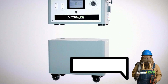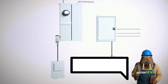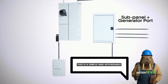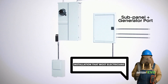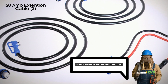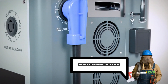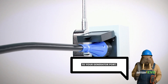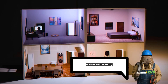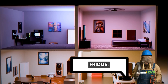Before you start, let's go over connecting your Walrus to your home. To use your Walrus to power your home, you'll need a sub-panel with a generator port that's separate from your main grid connection. This is a simple and affordable installation that most electricians can handle, but if you're a DIYer, we've linked a step-by-step walkthrough in the description. Once that's installed, run a 50-amp extension cable from the AC out port on your Walrus to your generator port. Now you can use your sub-panel to decide what's getting powered off-grid, whether that's your whole home or just essential circuits like lights, fridge, and HVAC.